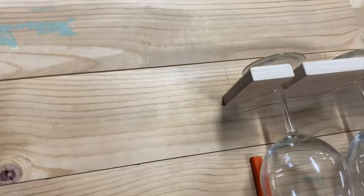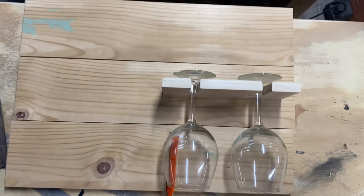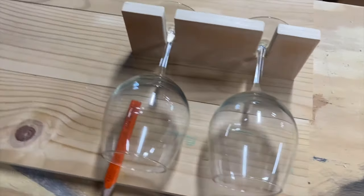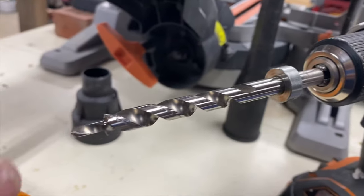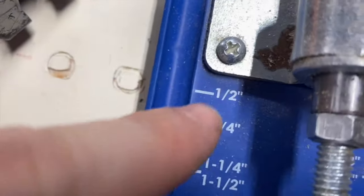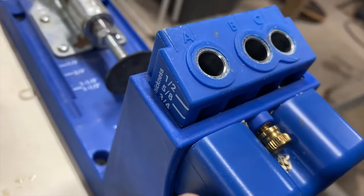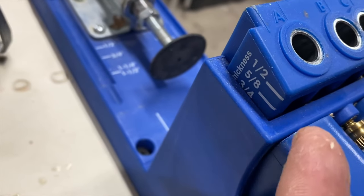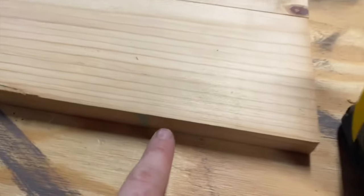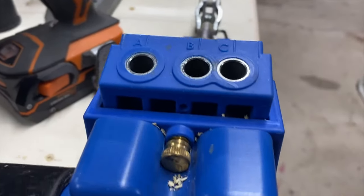Here's a quick update on the layout. I think it's going to look pretty good - we're getting pretty close to the overall design and I think it's going to work out really well. The pocket hole bit is ready to go and this is set up for the depth of three-quarter inch because that's the depth of the boards. I've got my guide set up to the same thickness, although I dropped it a little bit shy because these boards have been through the planer.